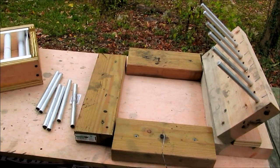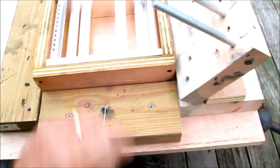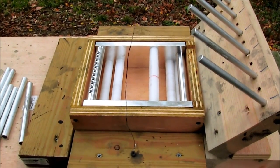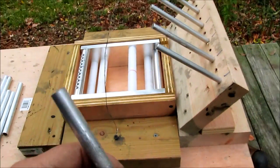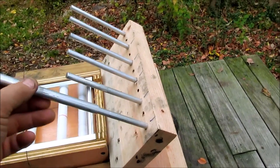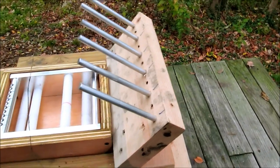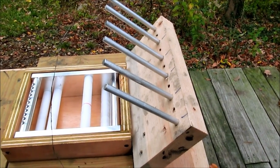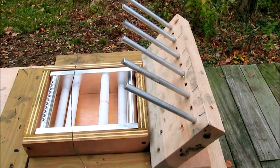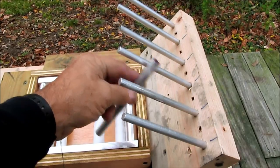Going to this jig or rig — the plywood box sits down in, held securely. I've got a wire that goes over this and secures on the other side to keep that from being pulled up out of its place. The spools that I'll be winding the string on are 1.5 inch OD aluminum tubes, 6 inches long. These fit over 3/8 inch aluminum rods that I have recessed in this angled wood brace bracket. I found that angling the spools was necessary to keep the string from grabbing on top of the wound-up string clump on the spools. It's better for the string to be pulled off into the machine at basically about a 90 degree angle to the spools.